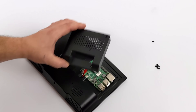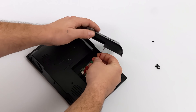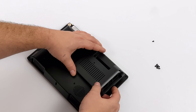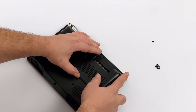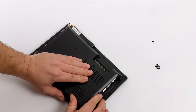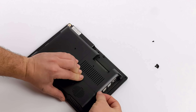Once that's done, we'll grab the back cover here. Don't forget to plug your fan in — it's got the little connector in here. This is actually running on 3.3 volts, so it's pretty quiet. It's really hard to hear this fan; it's not a super annoying one. Once the back is on, we're going to place the other screws in here and we'll have full access to the GPIO pins, Ethernet, and USB on the Raspberry Pi. Before you assemble this, make sure you have your SD card ready to go and insert it into the Raspberry Pi.